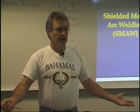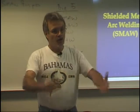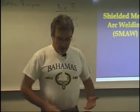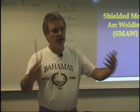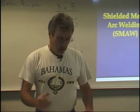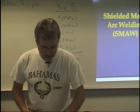How hot can it get? How high can your amperage go? How low can your amperage go? These are all elements that they call essential variables that will be in a welding procedure. And it's the same thing if you have to preheat something or heat it after it's welded to relieve the stresses. There are special techniques, and there'll be a procedure for how to do all of those. You're never left to guess when you're a code welder. There's always something written down someplace.